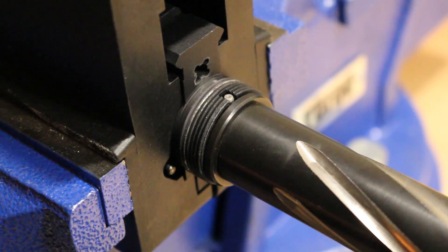Now I'm not looking for quarter-inch MOA at 100 yards with a .223, especially a .223 Wylde in an AR-15 platform. I'm looking for one inch or less — one inch, I'm very happy with that. Bedding your barrel should take a quarter MOA out of your grouping at 100 to 200 yards. You'll see a lot more as you go further down range — at two or three hundred yards is when it becomes very apparent how much we're taking out.